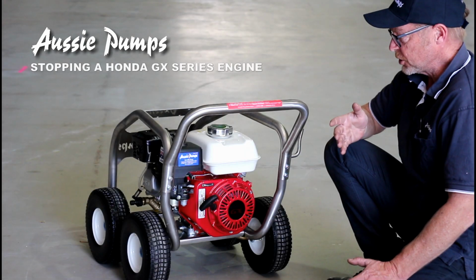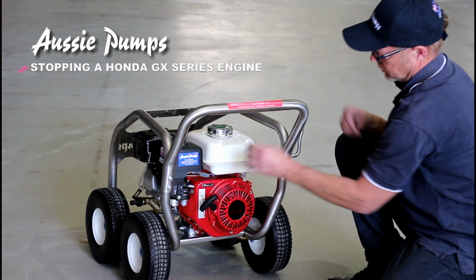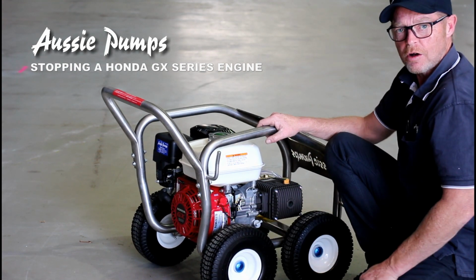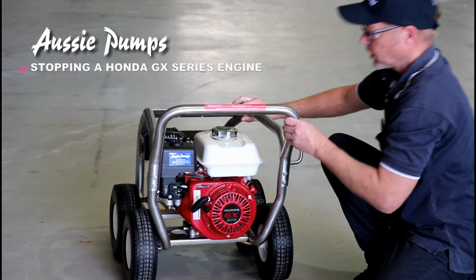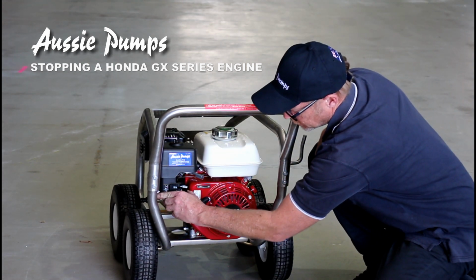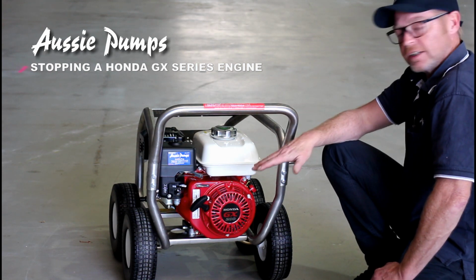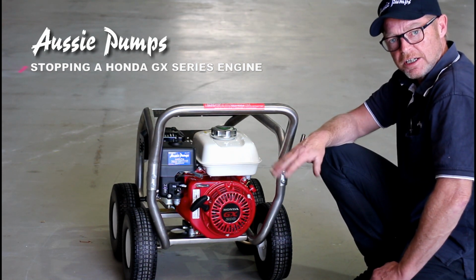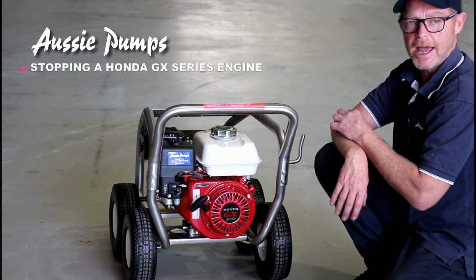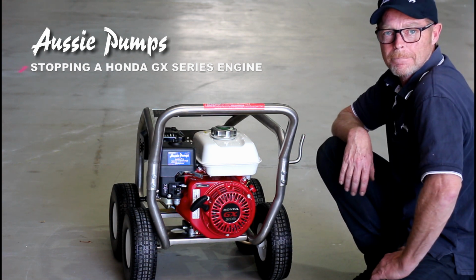When you're finished using the machine, bring your revs back to idle. Switch the machine off. Release the pressure in your gun and turn your fuel off. Once you've followed that sequence and you've released the pressure in your gun, you can turn your garden hose off so the water supply stops to the pump, and then you can disassemble your hoses and pack the machine up.